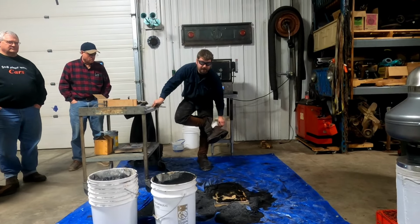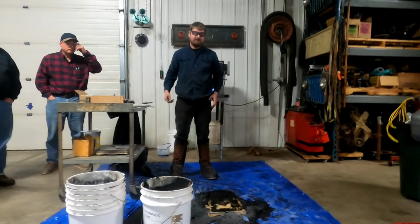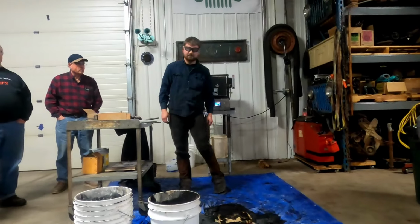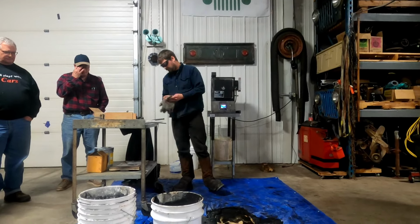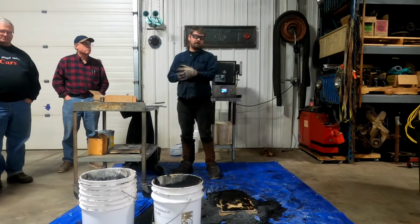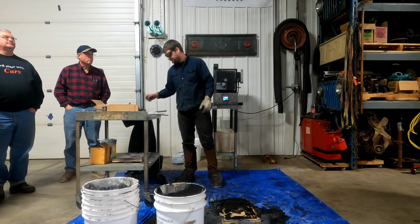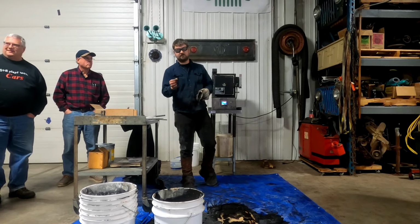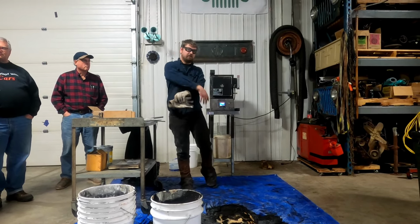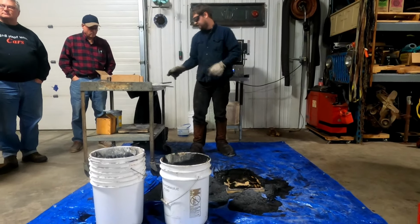I've been welding. You get a lot of sand and dirt in there. I dropped it on my boots. That's worth it, right? It is, man. The last time I went down the back of this boot, I had a scar for 2.5 years. Aluminum is the worst metal to pour from a standpoint of danger. It's lower temperature, but it actually wets to your skin and sticks. Iron and brass are dense enough that the sweat in your skin beads them and they roll off.